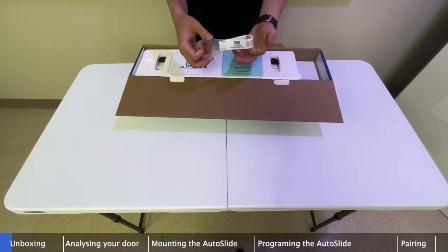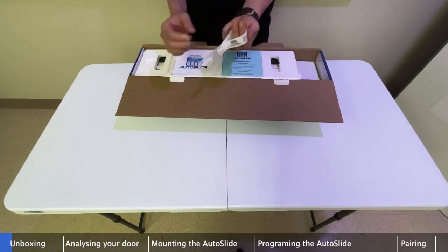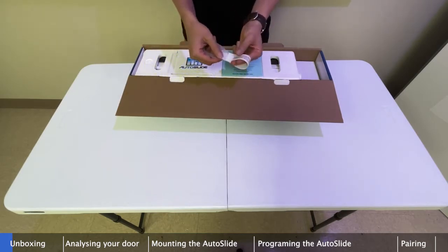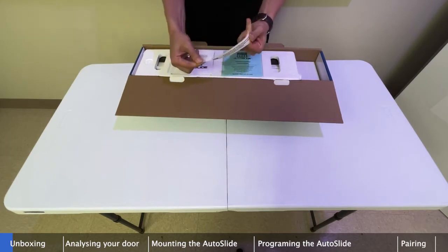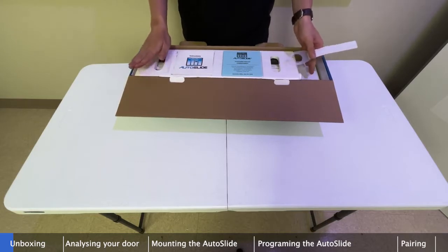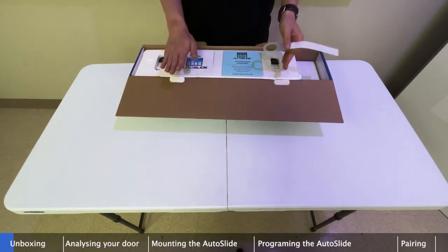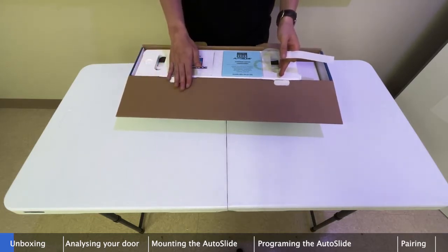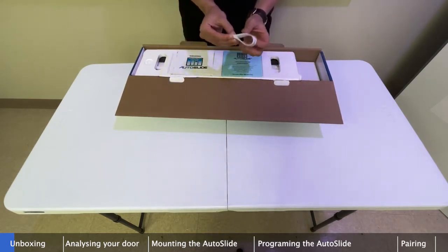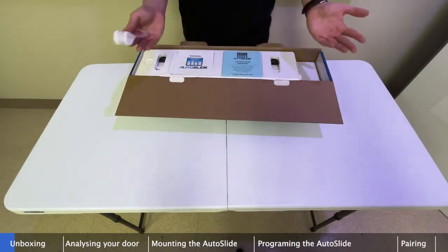Every time you close the door, make sure you close it fully into the weatherstripping and weather seal. If this strip breaks, it most likely will not work with a standard system — you'll want an elite unit or a multi-drive for that type of door. But if it opens and closes three times without breaking, you're going to be fine.